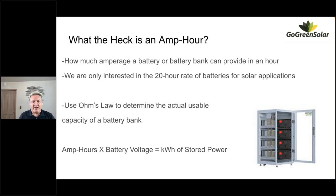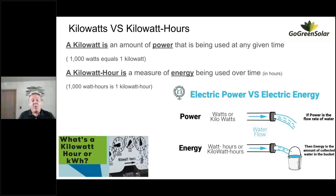That makes it a lot easier than looking at amp hours alone, because when you look at your power bill you're not billed for amp hours — you're billed for kilowatt hours. Finding that common denominator is the best way to go. Most lithium batteries are actually measured in kilowatt hours — they'll have an expression in amp hours but they're rated mostly in kilowatt hours, so often you can just look at how many kilowatt hours are in a battery.